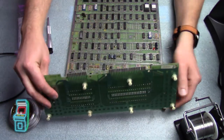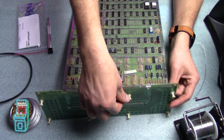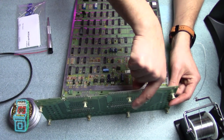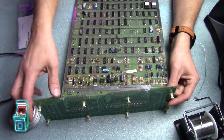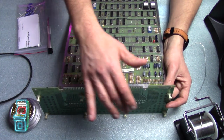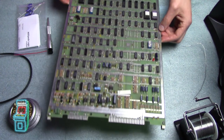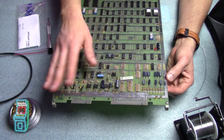There's a screw here and a screw here. When it's attached, you have to remove those two screws first. Then you pull on these little clips — normally they're kind of pushed in and lock into place, but you just pull them all out. You could actually pull them all out without taking the screws out and this whole thing will slide out altogether. But if you want to remove the filter board itself, you have to take off those two screws. I'm going to take it off and put it to the side. My edge connector is in pretty nice shape — I had already cleaned it, so I'm not going to mess with that.